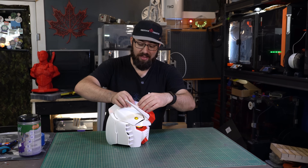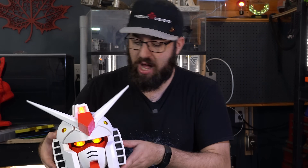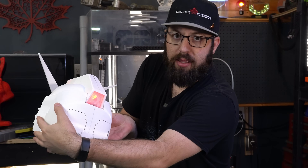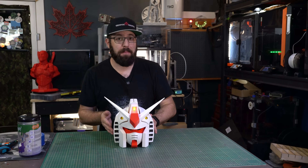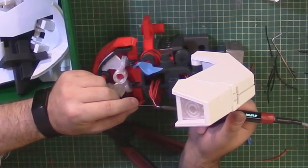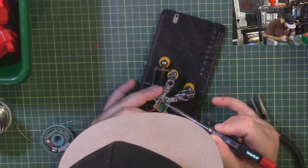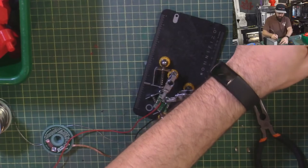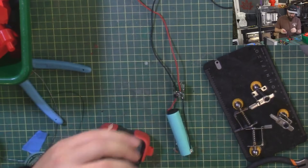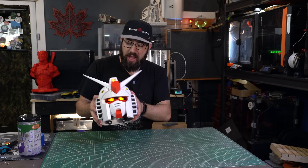That allows us to get in here, push the button, and turn on the LEDs, because if you can put LEDs in something, you put LEDs in something. The LEDs just make this pop. We have two orange LEDs in each eye, and then a singular red LED in the front and in the back. The wiring for this was very simple — it's the simplest wiring circuit in the world. All the red wires twist together and solder, all the black wires twist together and solder. To power it all, I used a cheap disposable USB battery bank that I picked up at a trade show. I gutted it, so it's just the 18650 cell with the PCB. I removed the full-size USB port and soldered on some wires, but we still have the micro USB so I can still recharge it. So yeah, that is the head of the Gundam.